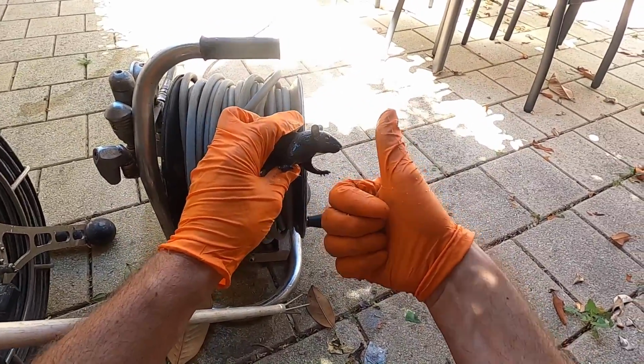See that little submarine piece? That's very important. If you can't get it out of there, can you already see a bit of dislodged pipe there? Alright, we're going directly into another dropper. And we're looking down another vertical from that dropper. Goes deep, and then looks like we might drop straight onto the mains there. And it's still got quite a bit of rootage in there. I'll just go in and clean that up, I think.